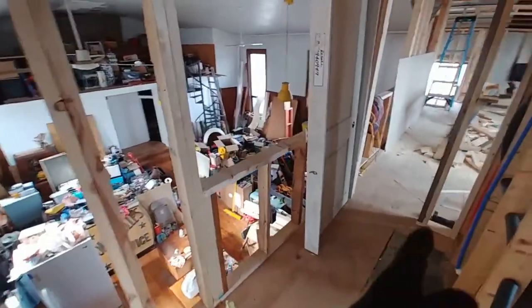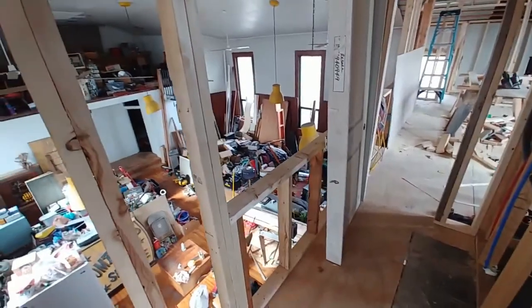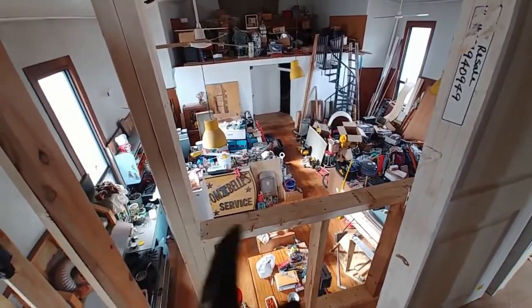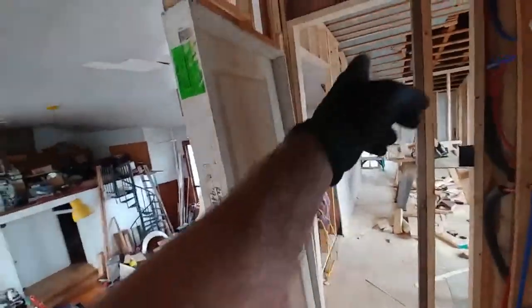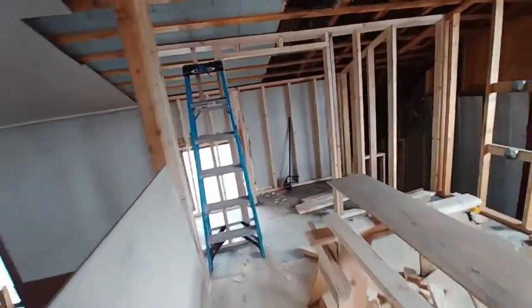We pulled out the front of this balcony by a couple of feet, and all the wall segments that came down had the four sides of a rough opening that were wrong for the windows here, kind of loosely framed in space, not conventionally framed. So those got broken down and essentially reused. Nothing was thrown away here, but this has been all newly framed across the front. Around this window is being framed now. Around the window over here for the closet is being framed now.